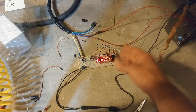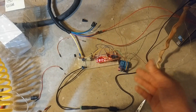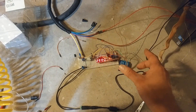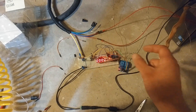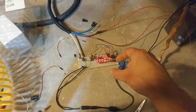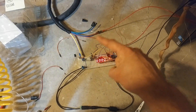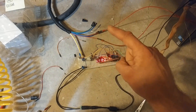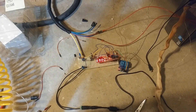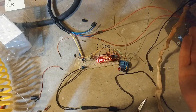It's just the regulator stepping down the voltage, putting out heat, getting unstable, and making it jump around. So my fix is to power it off 5 volts with a separate 5-volt power supply, isolated from the computer. Then there's a 3.3-volt regulator on here that should handle the step-down from 5 to 3.3 much more easily without going on the fritz. I can use that 3.3 volts as the reference voltage for the ADC, and then use another voltage divider to put the plasma signal in the range of 0 to 3.3 volts instead of 0 to 6. Day and a half of my life on a heat thing - but now that I've figured it out, it's a nice feeling. Now I got it, now I can fix it and go on from there.